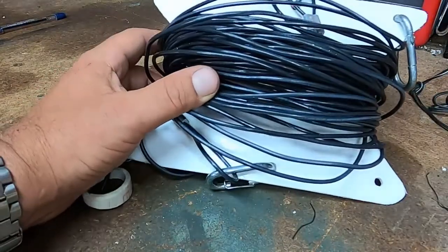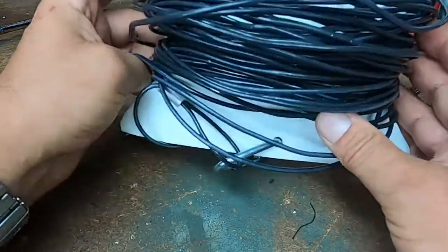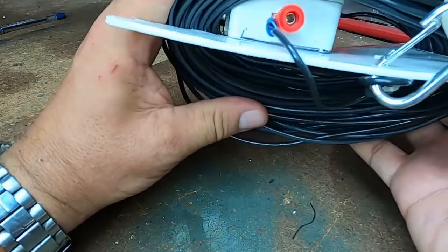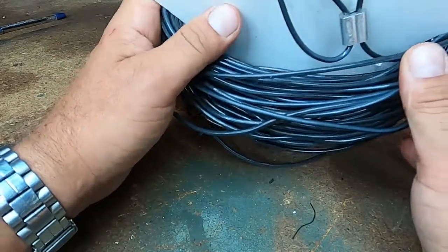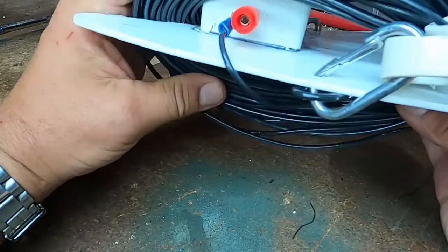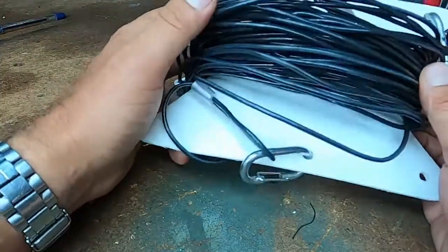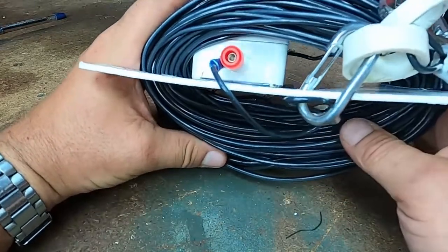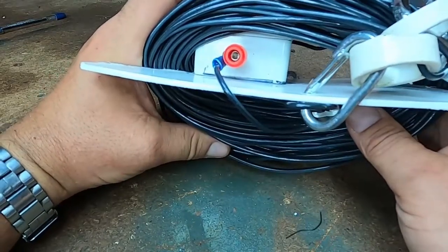And this antenna here is a portable multi-band HF antenna built specifically for emergency communications. This runs on HF bands, everything from 160 to 10 meters, and it will do 100 watts for single sideband, 50 watts for CW. So you can use this thing for many different applications. You can set it up and use it with an SDR or a shortwave radio for listening. You can use it for propagation.